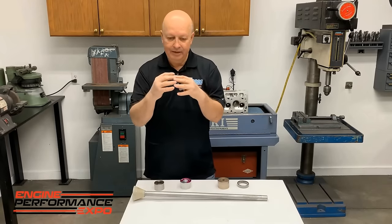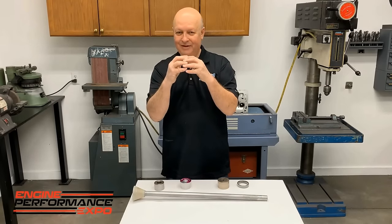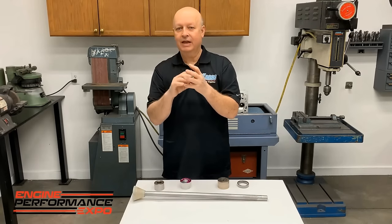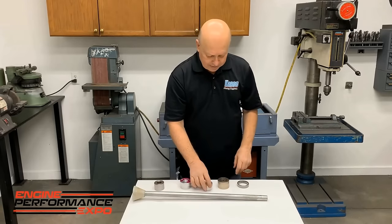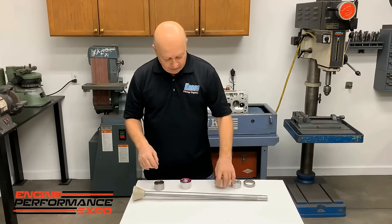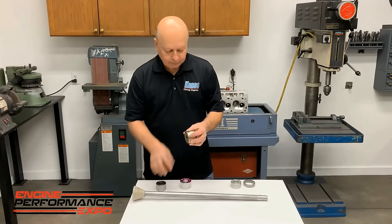Well, when you knock them in, that little place where the zigzag is, some of the babbit starts to fester out, and it's just enough to make the cam tight. And the cam goes in and it's real tight, and it's a big mess. So what we started doing, we made a tool for that, and then we made them for other things.